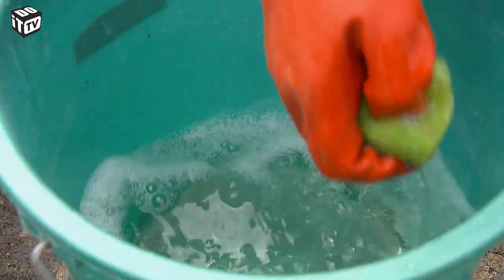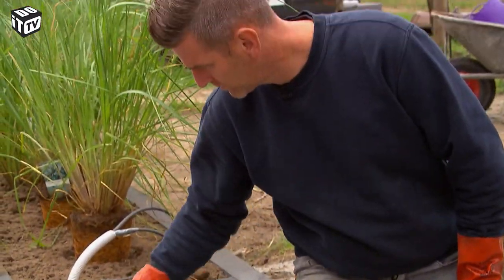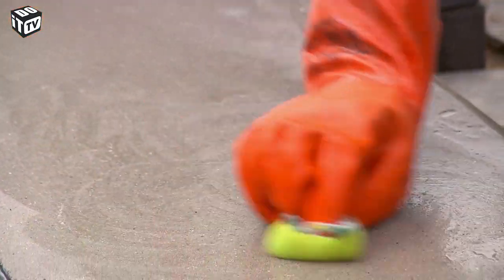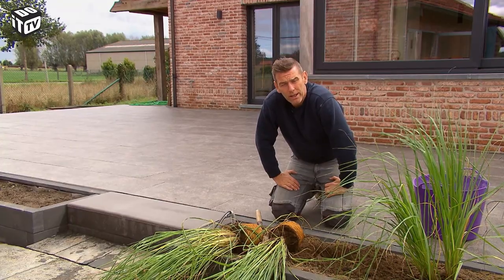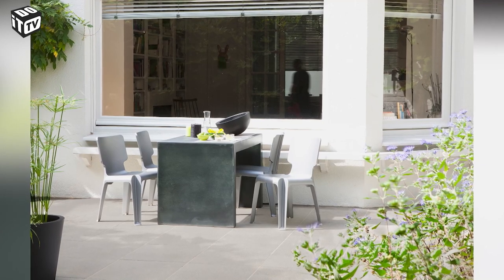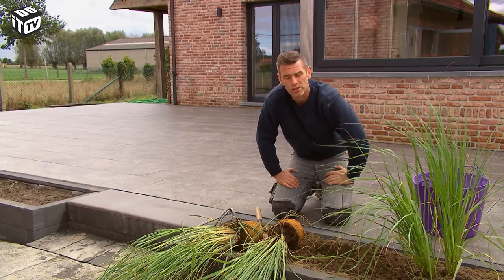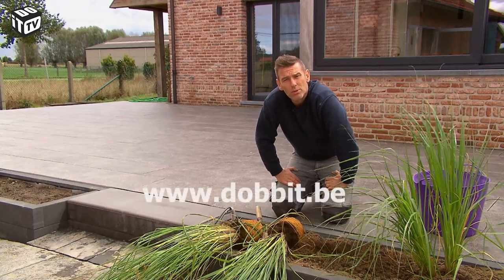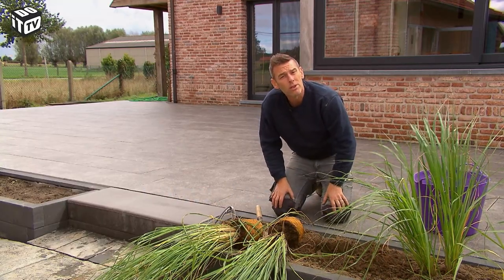Be sure to thoroughly read the leaflet when working with cement grout remover. Dilute the product with water and carefully apply it with a sponge to the dirty spots. Let it soak for a few minutes, then rinse everything off well. With good preparation, you can easily lay your own terrace. If you also choose the right products, you can not only create an atmospheric and well-maintained terrace, but you can also solve a number of problems, like with this flower box and the difference in height. I look forward to seeing you at the next job.